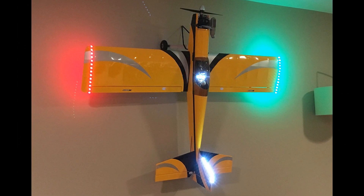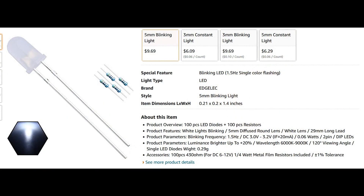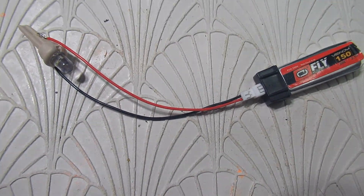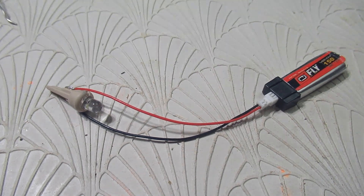Today's LEDs are really mostly directional unless you use ones like I'm going to use for the strobe — these are five-millimeter ones. You can buy these three-volt blinker bulbs anywhere for about ten bucks for a hundred. Or you can diffuse the light with lens covers or even the top of a felt-tip pen in the right color. The reason you can use the three-point-seven volt cell is because of the on-off time — it's not on long enough to burn out.